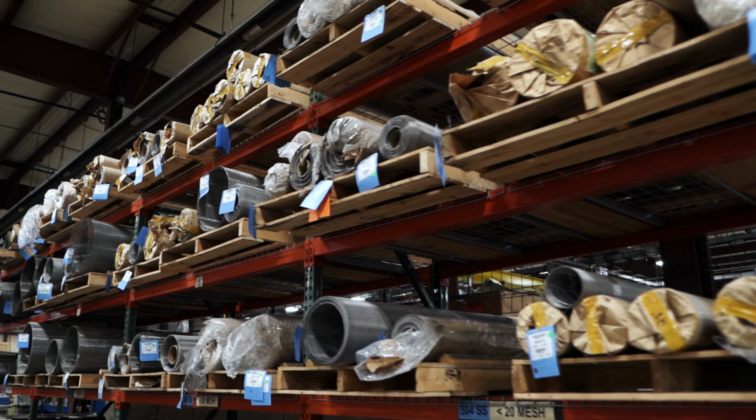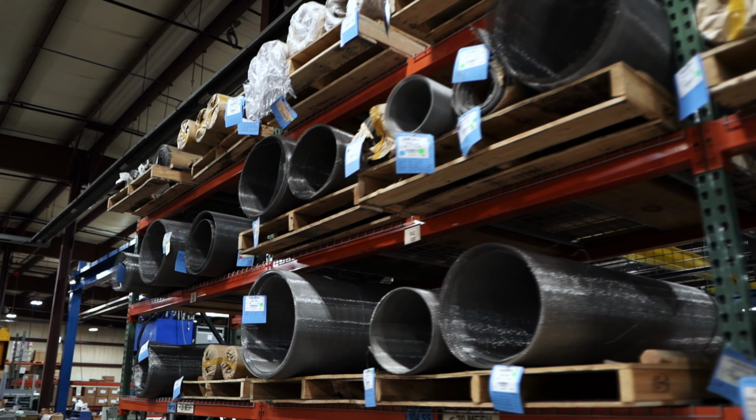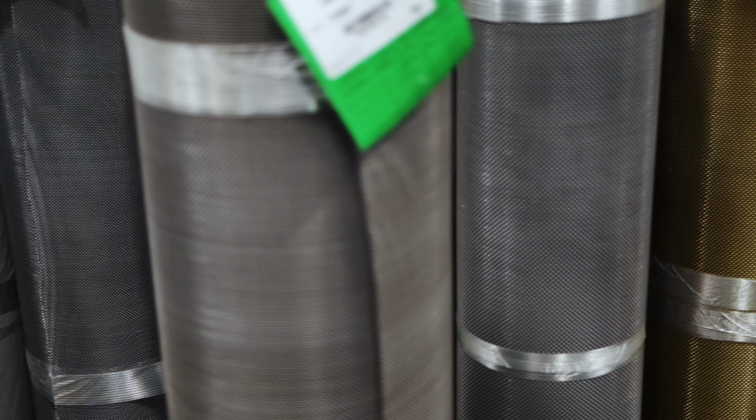The most significant factor that divides the cost of the two is labor. Basically, the more labor needed to heat treat your mesh, the more it'll cost. But I should say there's typically more labor required during the continuous annealing process, especially since only one roll can be heat treated at a time. And since several rolls of mesh can be treated all at once, there's not as much labor needed for the batch annealing process, which is why batch annealing is typically cheaper.